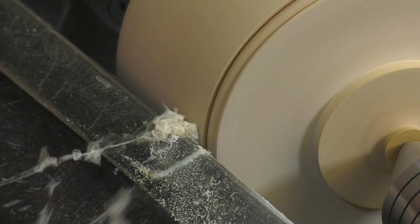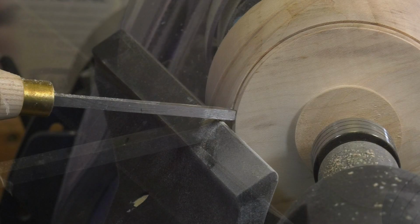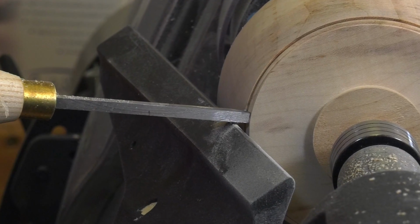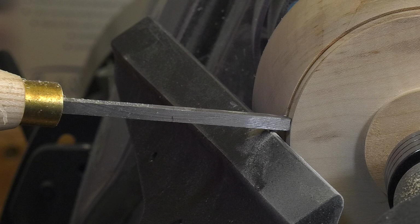Using the same knowledge as earlier regarding the side and the end grain, we need to set up the bead forming tool so that it will produce our beads without tearing the wood. We are going to use the bead forming tool in a downward, often called trailing action, so that the cutting surface does not drag on the side long grain and potentially break it. This way the grain is not hitting the cutting surface of the tool full on, but it is already starting to pass by the cutting edge as the surface is being scraped into shape.